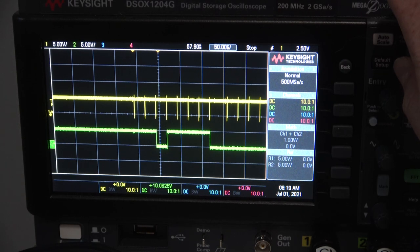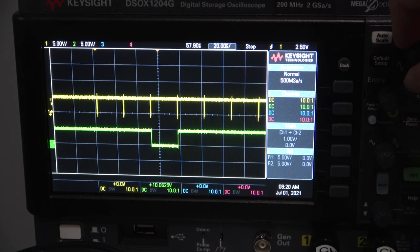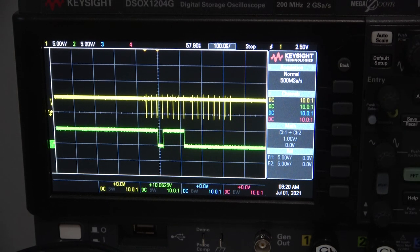So you can see the pulses coming from it, but thing to keep in mind when you're in the menu of the Nintendo thing, it's running an FPGA, but when you start the game, it's actually the game code driving these pulses. It's not just driving them, but reading them. And it's locked at like 1.6 megahertz, whatever the Nintendo is, so that's a big difference.